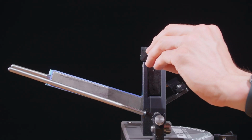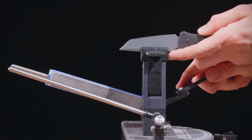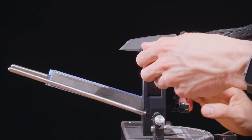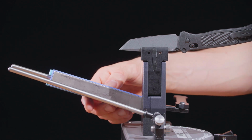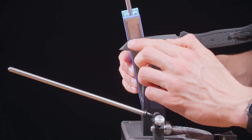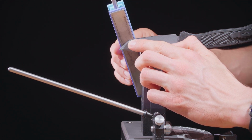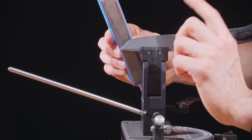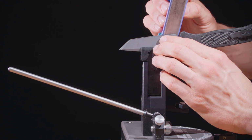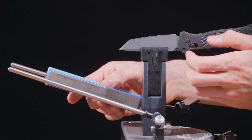We will begin with the Tanto. I am clamping this blade off of the top depth keyhole, since it is narrow, but yours may be different. I will then proceed to treat my two sections of the blade independently, my main blade and my Tanto blade, separated by this Tanto point here. Now we want to keep this Tanto point sharp, so I want to make sure I am not rounding over it with my stones as I'm sharpening. So to combat this, just keep that stone nice and parallel to that blade surface.